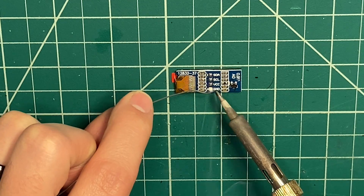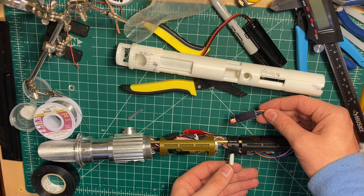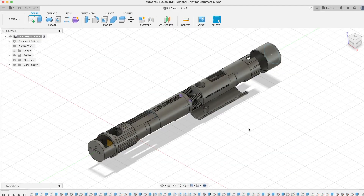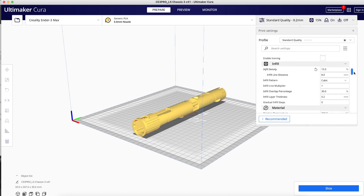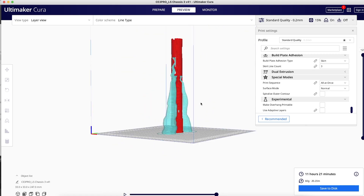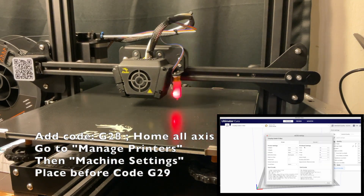Before printing the new chassis, I took some time to test my new OLED screen purchased from the Custom Saber Shop. I have a wiring diagram in the Google Drive folder linked in the description if you'd like to add this to your saber. To ensure your OLED is working properly, make sure to update to the latest firmware for the CFX, which you can find on Plector Labs' website. Then it was time to print the chassis. Fusion 360 allows you to export your model as an STL file, but you need a slicer application to turn that into a G-code file for the printer — for this I downloaded Cura Ultimaker. If you slow down the video, you can see the settings I used. I also added a command at the beginning of the G-code that tells the printer to use the BL-Touch to do 9-point leveling before starting the print.